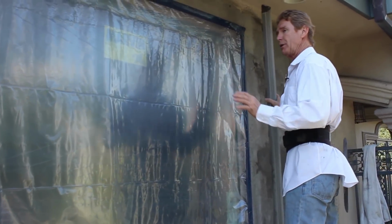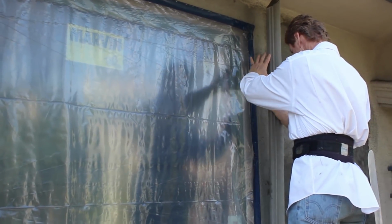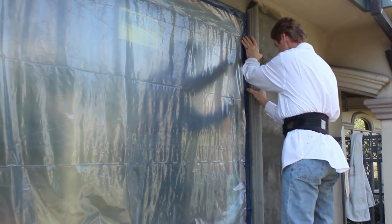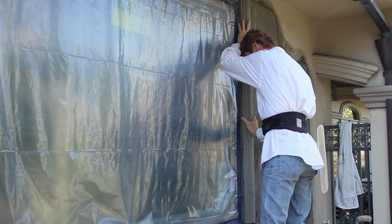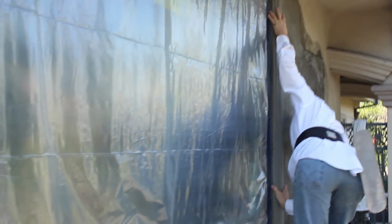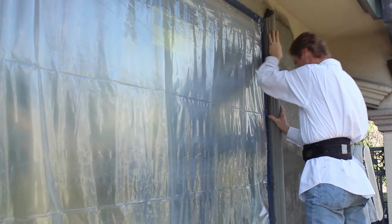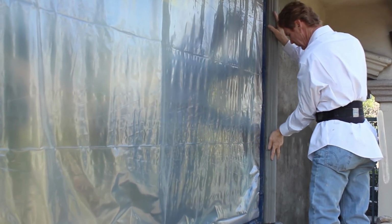So make sure you buy it with the cementitious finish already on them. And what we generally do, guys, we put it on, go up, down once, and it should adhere. That's the best way to do it. I use nails on the bottom because they're holding everything. You put it once, and you just kind of shake it one time, and then set it, and push hard too. If you're not sure it's going to adhere, go ahead, use a nail. Use a nail, pop it in place.